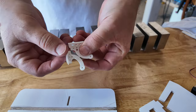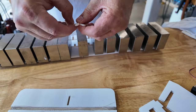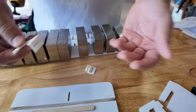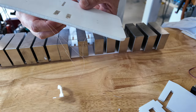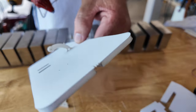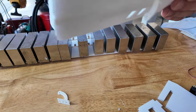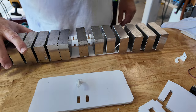Let's get some control horns. They're 3D printed - I put them on a sprue so I have a matching set. I would not mount this control horn in this configuration - I'd mount it like this, with the larger surface having more overlap with the underlying extension. In my builds the hinge line will be down, so it comes up from the bottom. Pop that through and hit it with a bit of hot glue. You see that hole in the center? I force hot glue through it - it acts like a rivet. Later during finishing I'll put a dab on the underside, but right now I'm not worried about it.